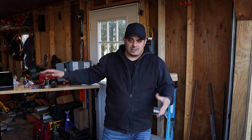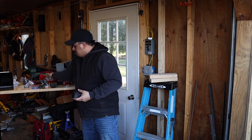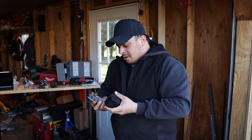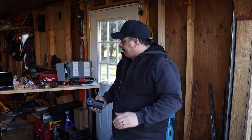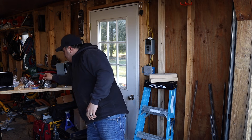I've got some other wire for the internal wiring in the shed. We're going to put in two 50-amp plugs — one for the electric heater, one for the welder. When all is said and done, we'll probably run a 40-amp breaker and a 30-amp breaker. I'll have to consider my overall power usage since my house only has 100-amp service, but everything is protected — if we go over the pull, it's going to pop a breaker.